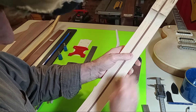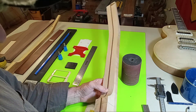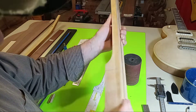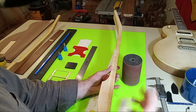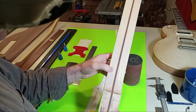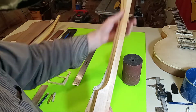Then I realized I had come dangerously close to the finish profile on one leaf. For a 1954 neck — the thickest neck ever known to mankind basically — I'm still going to be taking almost a 16th of an inch off this neck because I'm going a different route. But I'm showing you how to build a '54, '55, '56, and even '58 Les Paul. This leaf over here was about a 16th of an inch thicker, so I had to be very cautious working it down without losing that critical dimension.